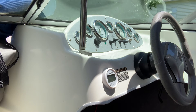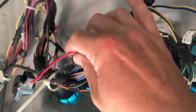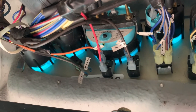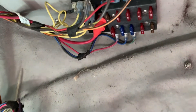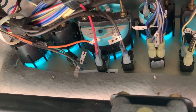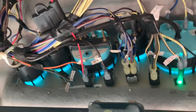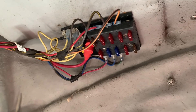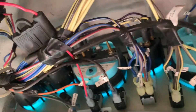I'll start to work on mounting that sending unit. Lock this bad boy into place and I'll grab a power and ground. I'll see if I can get underneath the dash here and show you where I'm going to pull that from. In my case, they had a depth finder already installed — it is to the very far right switch through the dash, and the ground block is right here. So all I have to do is tie in power there. You could also tap into anything that's keyed on any of these gauges. It's wide open and easy to get to.